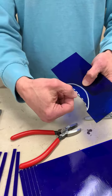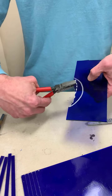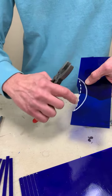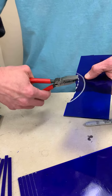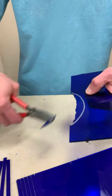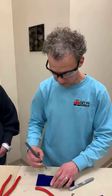So I did another one. Scored it — and again I just drew on the score line so you can see it easier at home. I'm going to come here and grab it down on this end. One important thing: grabbing it here, if something goes wrong it could break up into that piece. So if I grab it here, if something goes wrong, more than likely it's just going to break into the part I'm trying to get rid of anyway. Don't let your fingers stay under that score line. I'm grabbing it here and then just going to pull that out.